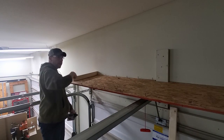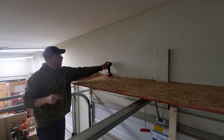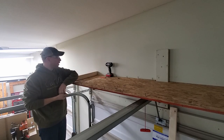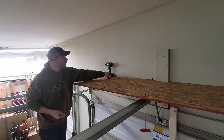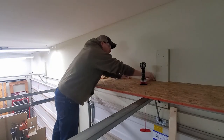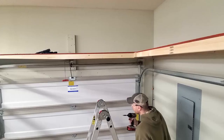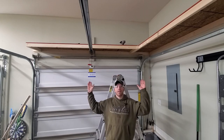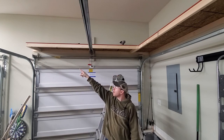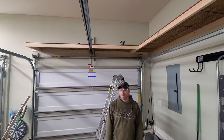I just cut the frame for over here and along the other side off camera. I'm going to come back in and attach these to stiffen things up a little bit, then locate where we're going to put our threaded anchors, drill our holes, and add the threaded anchors. I'm attaching this bit of frame to reinforce everything. Now I've got the shelf roughly framed and up. The next thing is to confirm my rafter locations, mark plumb lines on the frame, and drill for the eye bolts to start attaching to the all-thread.